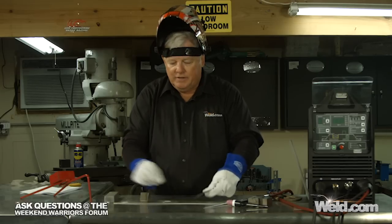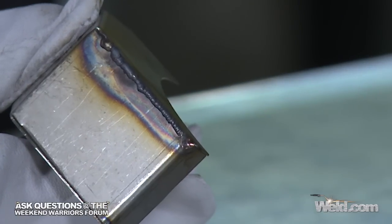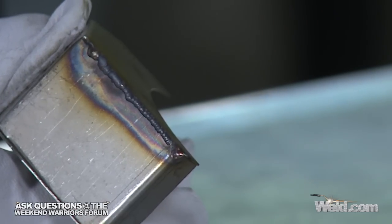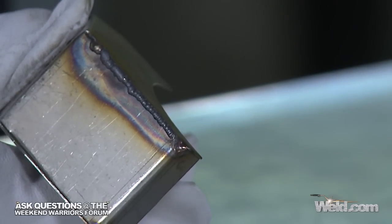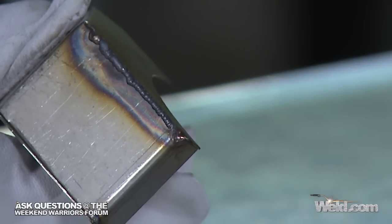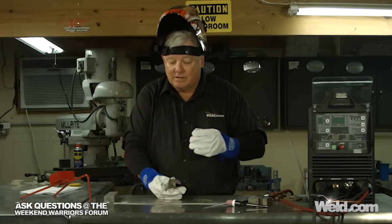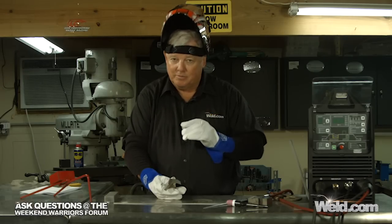Now this, being a trail cup, these things are almost impossible. You're trying to make a real lightweight trail cup. So this is lightweight stainless, and it'll polish out. It'll look like a mirror when it's finished. But you can tell by this weld right here that it is difficult. And I think I was using somewhere between 11 and 15 amps to weld it. Again, the machine was very stable. As far as I'm concerned, it passes the low end, and that's critical with me.